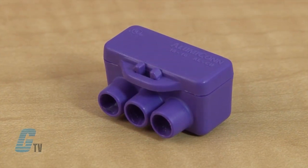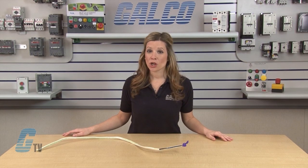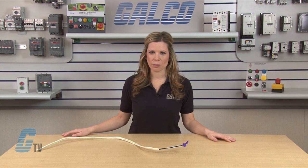These connectors can be used in industrial as well as residential wiring when the need to repair aluminum wires is required. Currently, the Consumer Product Safety Commission only approves of three methods for a permanent repair of aluminum wired homes. The first is a complete rewiring with copper wires, the second method is pigtailing using special crimp connectors called Copalum, and the third is using the lug type Alumicon connectors.